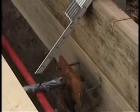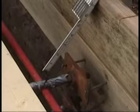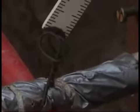One problem we want to prevent with this tie again is that our top cables aren't flopping into the beam area. They have to have a wire here as well to hold this top cable once it comes out of the anchor at the top. See where this wire is wrapped around here, to prevent what I call flopping in the breeze into the beam. It must be secured as soon as it comes out of the anchor where it attaches onto the tendon.